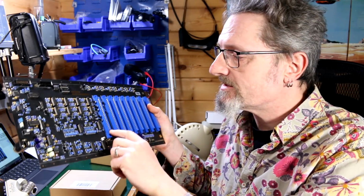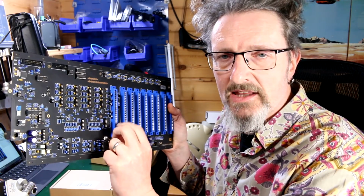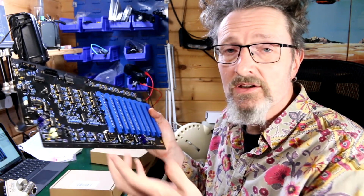Oh, gee whiz. So the cards, the voice cards that go in here, have to go a particular way around, which makes a lot of sense. And the cards have a nick in it, and it needs to be orientated on the little polarizing key that you stick in here. And that means that you can't possibly plug it in the wrong way around, which sounds like a good idea. Also, it sounds to me like that's not entirely essential, but is probably a good idea.